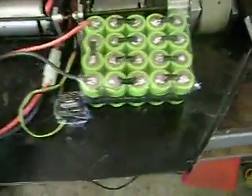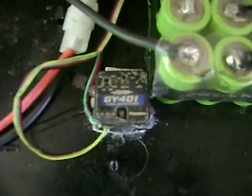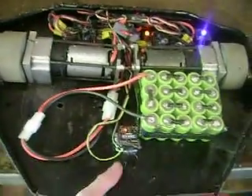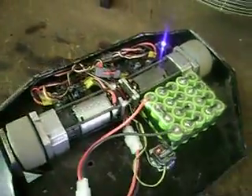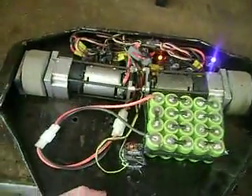About 30% gain, which is heaps for this. Now we'll turn it on again. I should see it flash and then come on solid. There we go — so now we're in the heading lock mode. If we just turn it a bit, you'll see it'll keep on powering the wheels more and more until we're back to the centre.